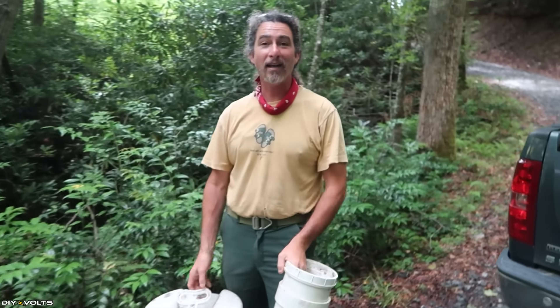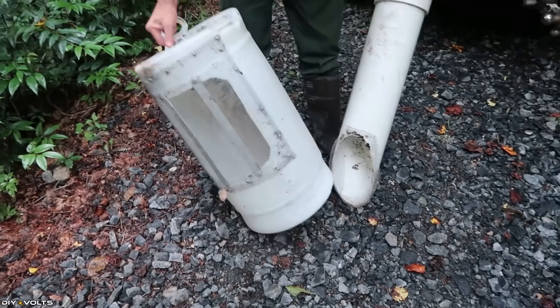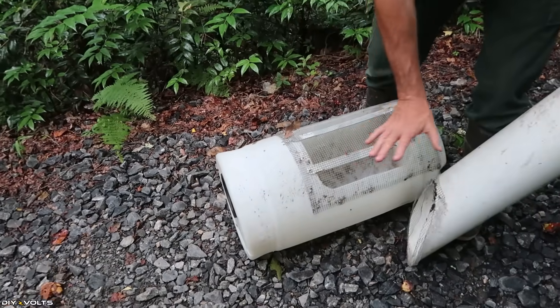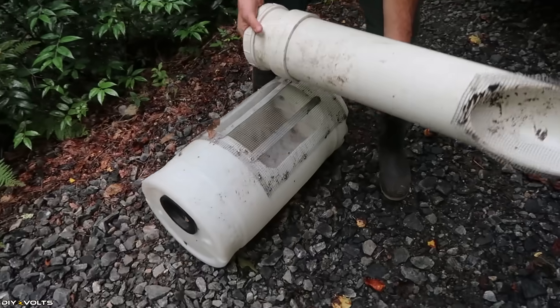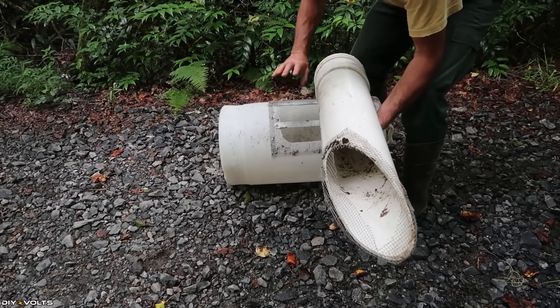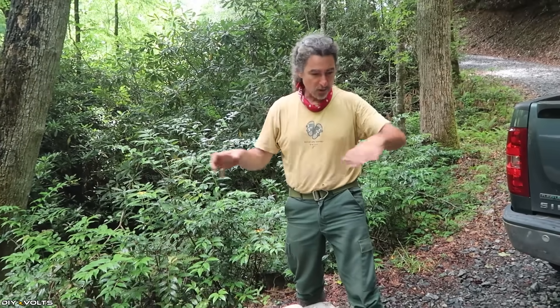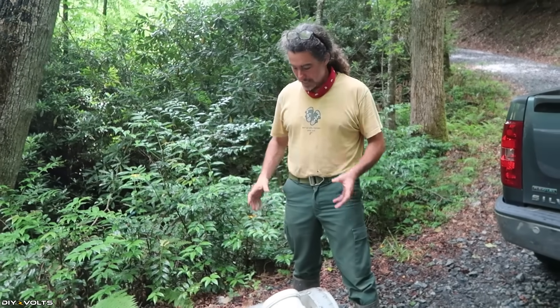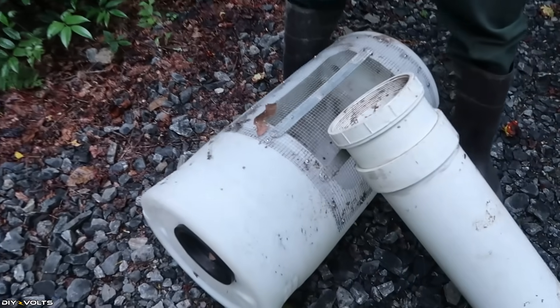This is my third attempt at intake design. The first two were pretty much epic failures. This was the most epic of the failures — when we get down there it'll make more sense. There's a rock ledge where I could get water flowing into this thing and the penstock came out of there. I had it in the creek running into here and it was doing pretty good, but it immediately started to clog. It filled up and was running fantastically, but I was a little over-ambitious on my site selection. It's wide with multiple little places where the water's running, so I used rocks and patch clay — it took me all day. It looked great, was running great, I was just like, yes. But I came back the next morning and had to go look for it down the creek because the clay is just not substantial enough to hold back that kind of water pressure.